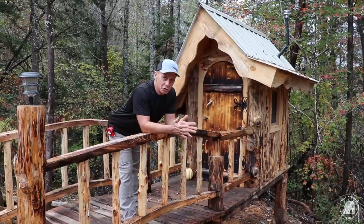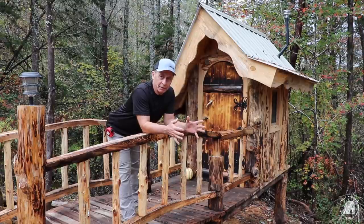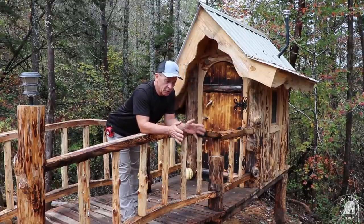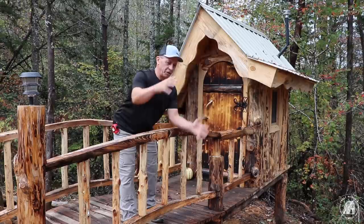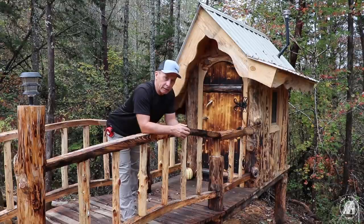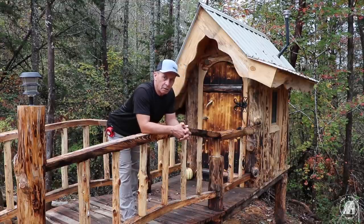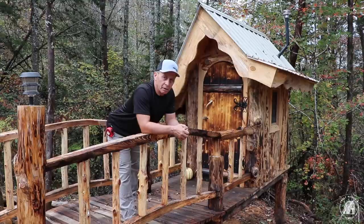So if you're a new subscriber, what I did was I've got a compost bucket in there basically, which contains the solids, and then I've got a liquid separator which has a hose that I ran down in through the woods. I dug a hole, filled it with big rock, probably about this deep and about this big around, ran the pipe down in there, put a screen on the bottom of it, so all liquid goes down in kind of like a leach field. And so far, like I said, zero smell. So I'm really, really liking the setup for this compost toilet.